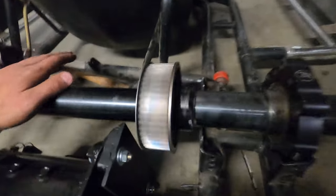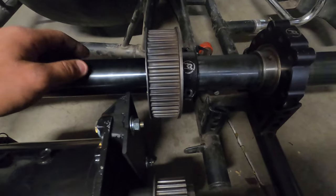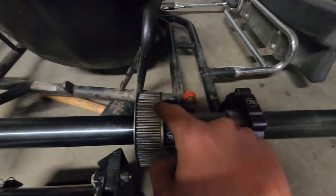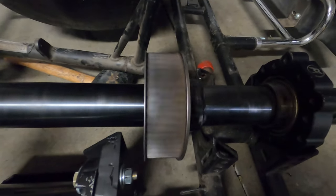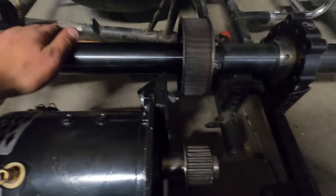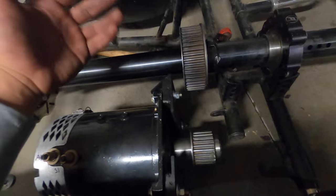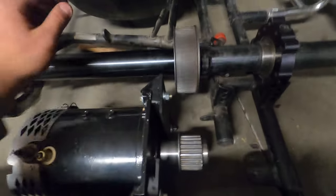That's what it looks like. It would be a bad alignment if it was going sideways, but since I only see it going up just a tiny bit — less than a millimeter — it won't affect anything that much. It's a belt-driven system anyway, so it's rubber, and it won't really do too much damage unlike a chain where you have metal touching metal. I think this is pretty good.